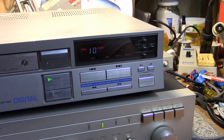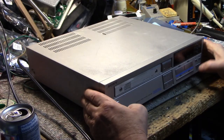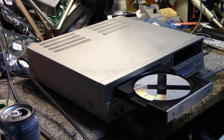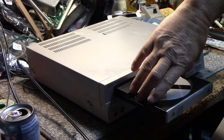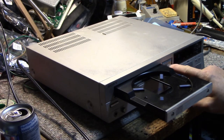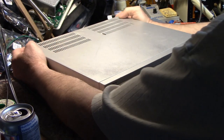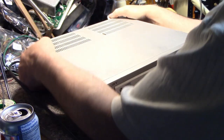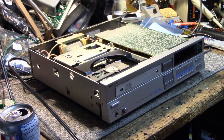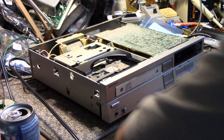Let's pull the cover off and see what it's not doing. We definitely know we've got a problem here. We've got a noisy tray — there are gears in there making a lot of noise, which I think is a grease problem. It used to be silent. Let's get the screws out. Now look at the dust on this.